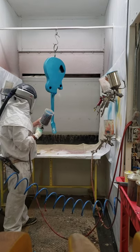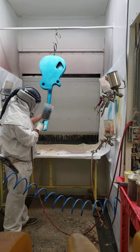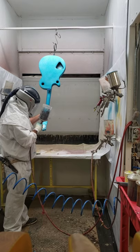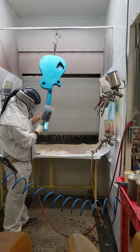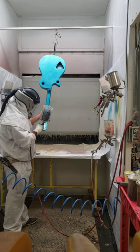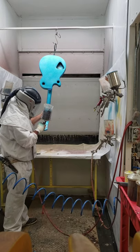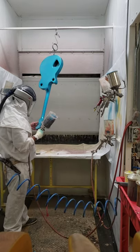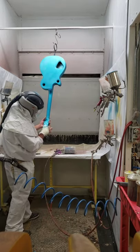Making sure my gun's not spitting. Whenever you're barely pulling the trigger, sometimes it spits — same thing with an airbrush. If your paint isn't just right, it spits little blobs. Lots of air and a tiny little bit of material and you get that spitting thing.